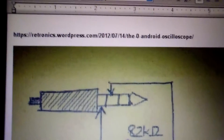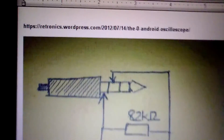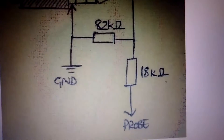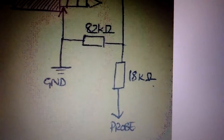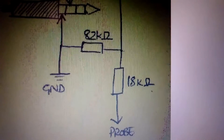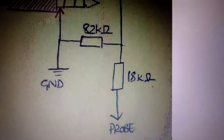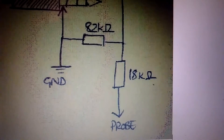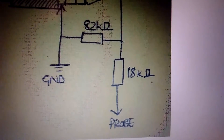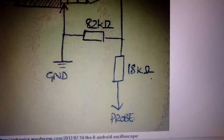Here's the website for more information on this. The resistors form what you call a voltage divider. You don't want any voltage to exceed 3 volts going to your cell phone. You might push 4 — I guess 4 would be okay — but you want to stay around 3 if you can, 3.5, below 4 volts.